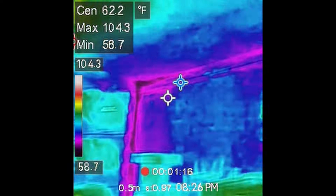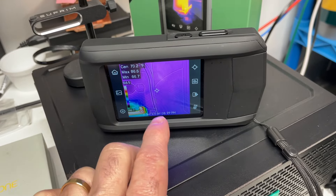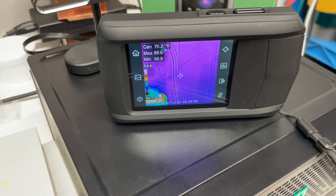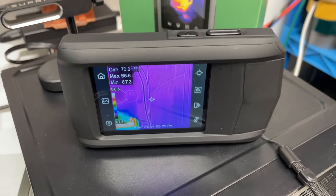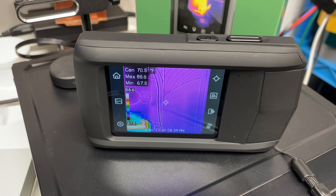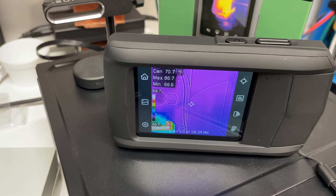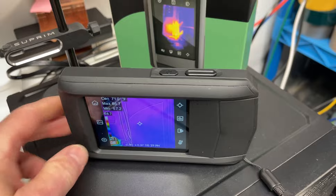You may have noticed during some of the video clips a clicking sound followed by the image freezing momentarily and then skipping — that is completely normal. I contacted the manufacturer to verify it, and my older FLIR One camera does the same thing. The manufacturer's response was: the imager will periodically calibrate to optimize image quality and measurement accuracy; the image will pause briefly and you'll hear a click as the shutter moves in front of the detector. Self-calibration will be more frequent during startup or in extreme cold or hot environments.